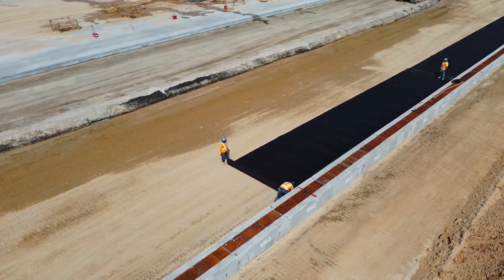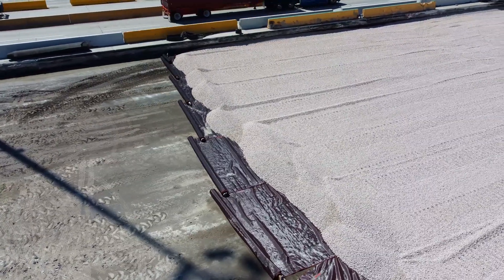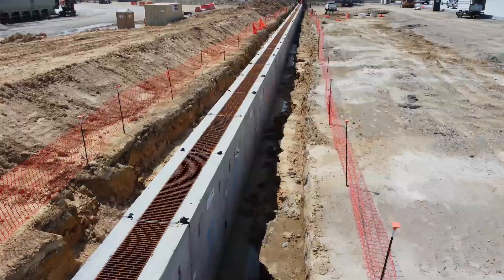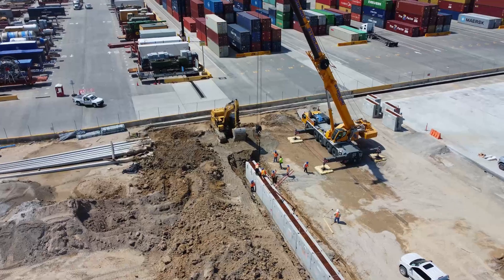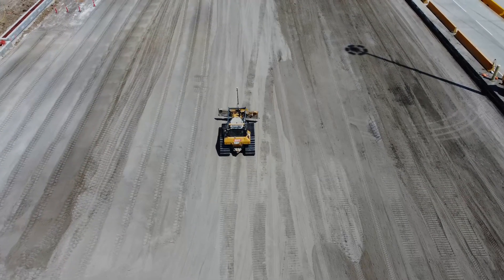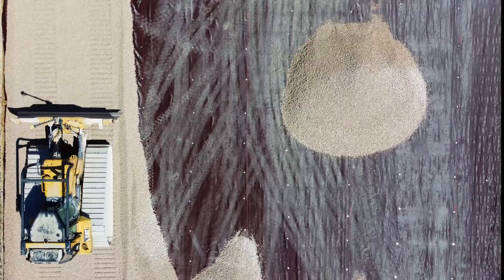This fabric has very fine openings — fine enough to allow water to seep through, yet too small for clay particles to pass through. As water finds rock and gets into the drainage layer, it will quickly travel on slope toward culverts and trench drains that will move water away into the drainage system. This way, the subgrade would always be dry and clean. So we place a layer of geotextile fabric, and on top of it we place 4 inches of rock.